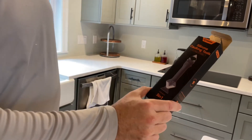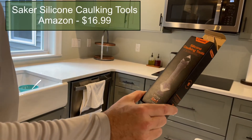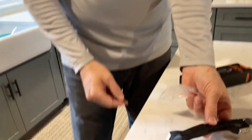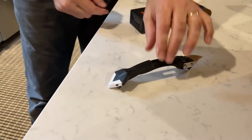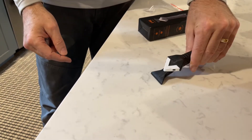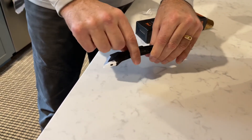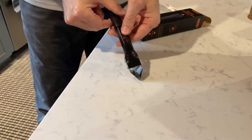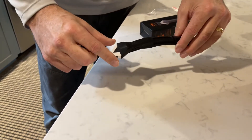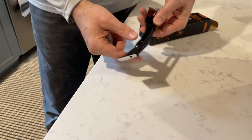This is a three-in-one tool from Saker — S-A-K-E-R. Not sure where we found it. The interesting thing with the tool is that it's curved, which is super helpful getting in and out. You can actually use this one tool for scraping, and sliding it over — this is what curves the caulk. The other side is actually for taking caulk out, either pulling or pushing. I haven't used that much because I'm at a new construction site. But anyway, this is super helpful.